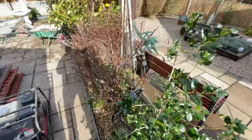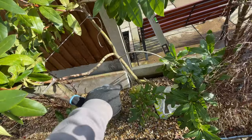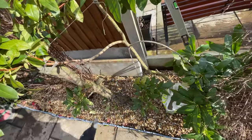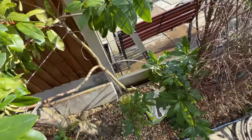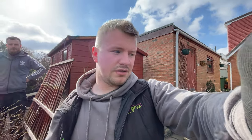Lovely. We've had the same issue over here, because usually you just dig the concrete out from around the post. We had the same issue when we did that one there, because as you dig around it, the post is just falling apart, so you can't even lift the whole post out. A couple of them have cracked and snapped. We've had to cut it and then try and get the post with the rebar and the concrete around it. It's taken like 3 times longer than we planned.